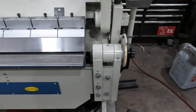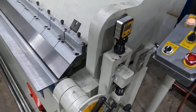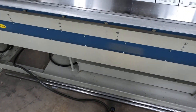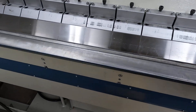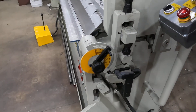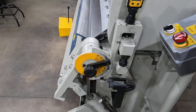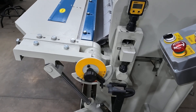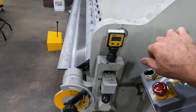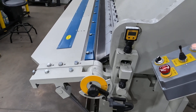I'm going to fire it up real quick — we're running off a phase converter, not that it really matters, but it does work. Pump on. In order to get this to go down I'm going to have to hit clamp — that closes this assembly here, which is adjustable on those end brackets. I'm just in inch mode right now but it will go up until it hits the limiting switch, at which point I'll have to send it back down. If I kick this over to auto mode I could hit bend and it will cycle through without me touching it, up and back down again.